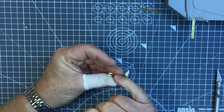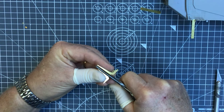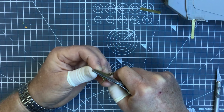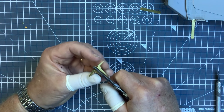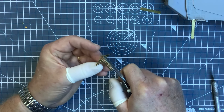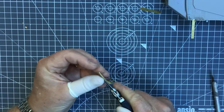So here where we've got this ladder arrangement in the centre, the sides fold up around the ladder. It's easier, I think, to fold the sides up to the ladder. So you isolate the delicate ladder rungs. And it helps to avoid twisting them. Now I just make a start on both sides. Just get the bend going. And once that bend started, the rest of it should go without any major distortion. Can do some last little adjustments with the smaller pliers just to square it all up.